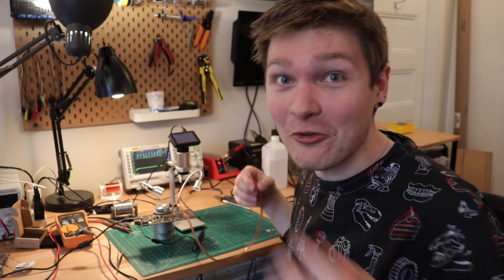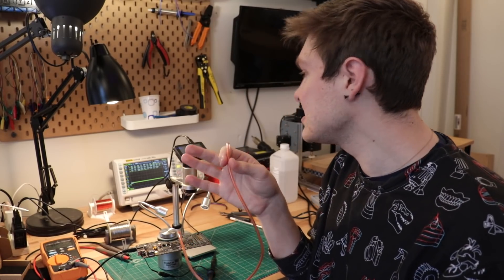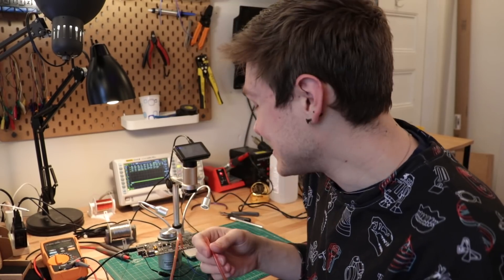I think I'm starting to get a hang of this whole op-amp thing. I looked at the schematic and was pretty sure I had to change a specific resistor value to bring the center point down a little bit so I could see a longer stroke — get the entire signal within the 0 to 3.3 volt range of my ADC. And sure enough, it did it! So now I have the whole range of pressure — at least what I can pull with just my mouth — from about 670 millivolts to about 3.1 volts. I can get a beautiful analog signal out of this.